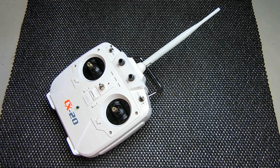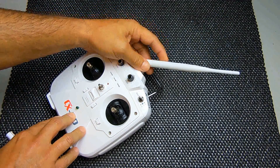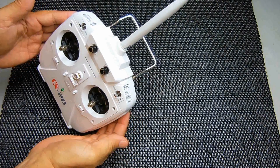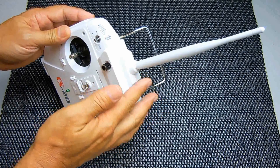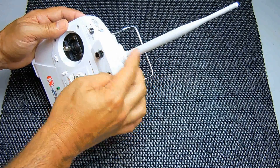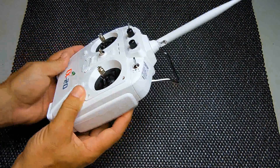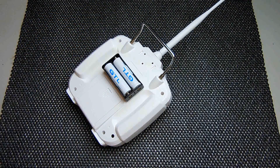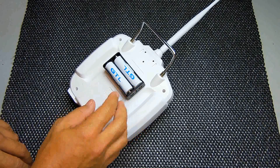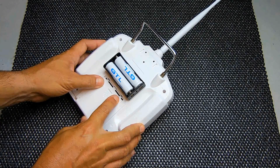That is why I did this modification. If you look at this you're going to see there's an extra green LED right here. The antenna was replaced with this nice 2.4 gigahertz antenna — this was the original — it looks very professional. You don't see anything sticking out, any modules. I've seen a lot of videos where even though they work, it looks kind of rigged. You can see all the wires and the RF boost module sticking out. All you see here is the LED and the antenna. On the back I decided to take two 18650 cells in a two-cell holder which fits perfectly between where your hands would go, and it does not interfere in any way with the battery compartment.